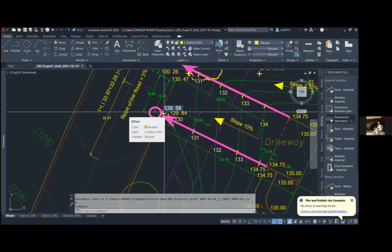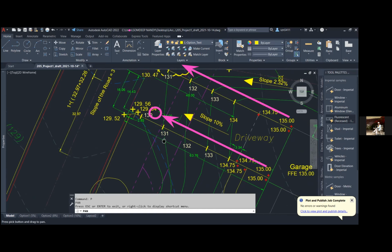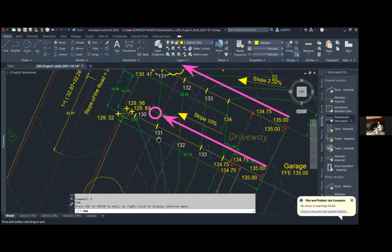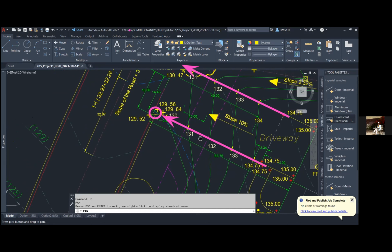I consider the middle of the slope, middle of the road, and then I get that corner. So I use the max 10%, then 5%, then I get the 135. Okay, then there is something might be off. If you use the middle of the road and did the 10%, actually that means the lower side. This will be over 10%.